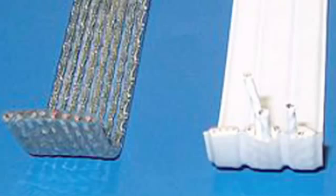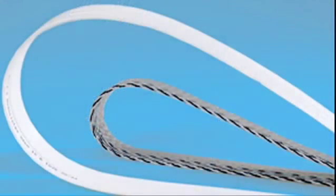In the case of shielded cables, the cores are wrapped up with fleece or foils. However, this type of construction means that during the bending process the inner radius compresses and the outer radius stretches as the cable core moves.